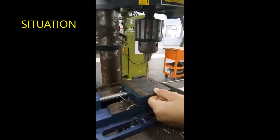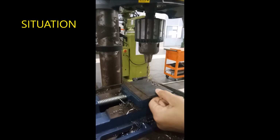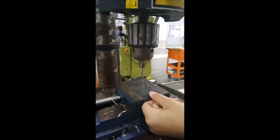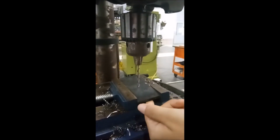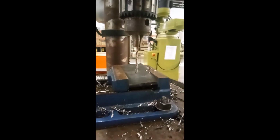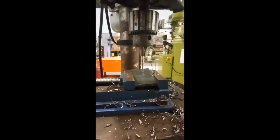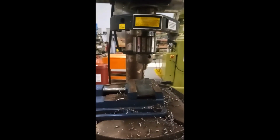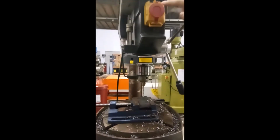This is used to show the standard which is not practiced: holding the workpiece by hand when the drilling machine is functioning and without being tightened by the clamp. The workpiece must be secured with bolts and strap clamps, C-clamps or fixtures. If the workpiece is not secured correctly, the clamp may come loose and the workpiece may fly off the table. Don't try to stop it from turning with your hands. Turn off the machine quickly if the drill breaks or comes out.